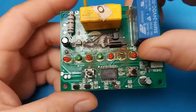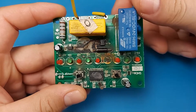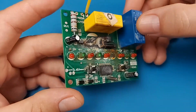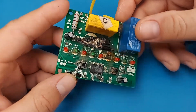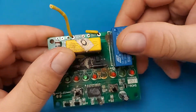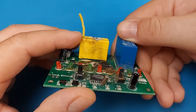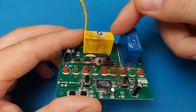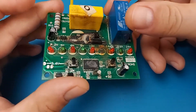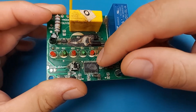That basically means this board is officially dead. We can probably salvage some of the parts — most notably the relay for some other project, and maybe this power resistor. I'm not sure about this capacitor; based on the multimeter it seems to be acting fine, but seeing the amount of damage that happened it might not be wise to use it.